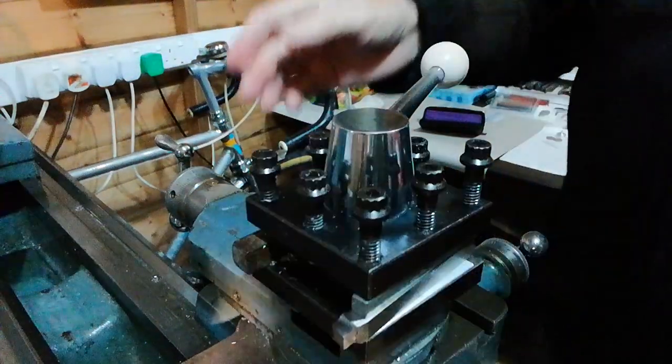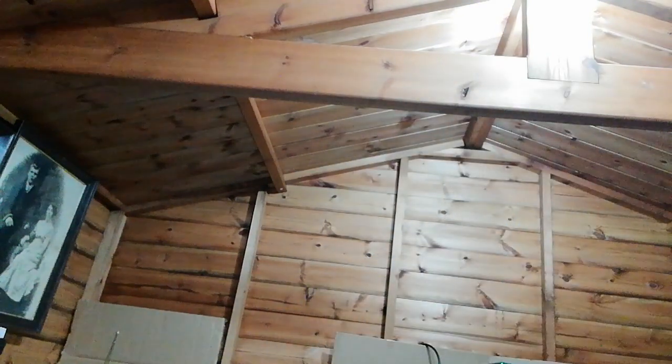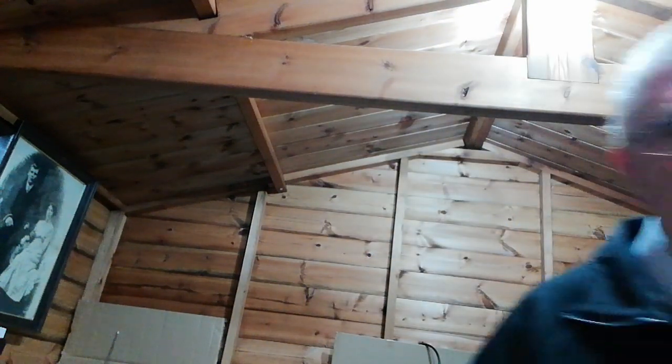There you go. What we've got here now is the tools are all set up. You'll see this is a very quick way of doing it. The other method people use involves measuring with rolls and things, but it's much easier, as I say, to use a centre, because it's hard to determine what the centre height of the tool is from that position otherwise. I've been doing this a long time, many years, and that's the way I always do it — it's quicker.